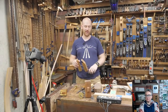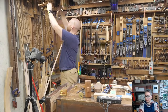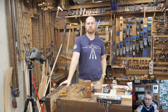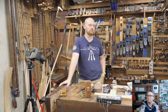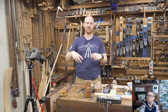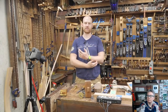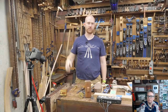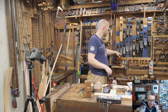Michael C wants to know: could you bore out the hole in the tenon first before cutting the mortise? Sure, you could — don't think it would make any difference. The problem people see is blowing out on the inside and losing a few chips, but because this is a joint designed to work without glue it doesn't change the strength or integrity. Those are fibers on either side of the hole so they don't add structural strength anyway.